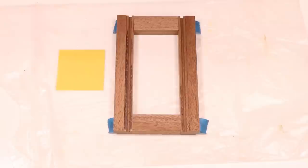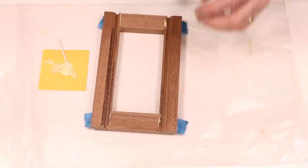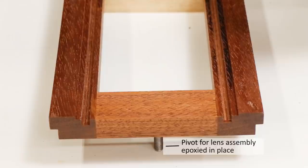While the pinions are steel, the racks are acetal, a rugged engineering plastic. Acetal has several virtues. Precision parts can be molded, which makes the parts much cheaper than their metal counterparts, which have to be machined. Acetal is also quiet and slick, requiring no lubrication.